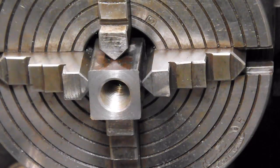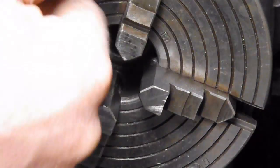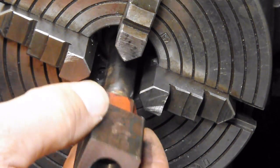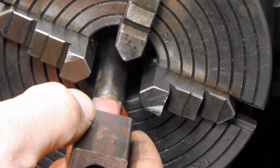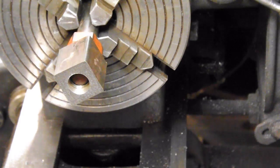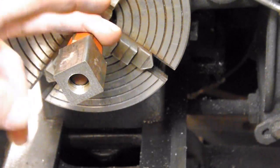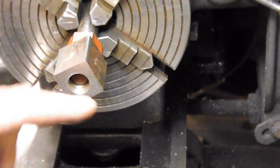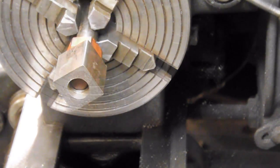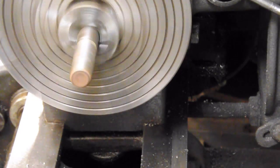I think I like that. So I'm going to take that out of there and put the nut on the bolt and center up the bolt. I'm going to find a different bolt because I have it running with less than a thousandths here at the shoulder of the bolt, and this thing looks like it's roaming everywhere. You can see without the piece on there — it's not running true, it's bent.